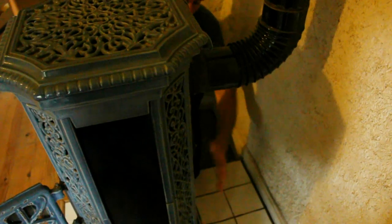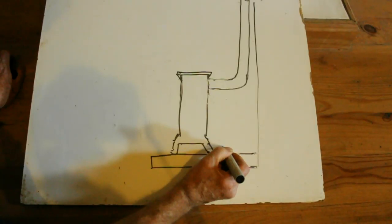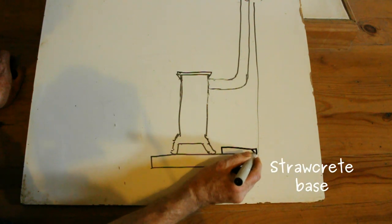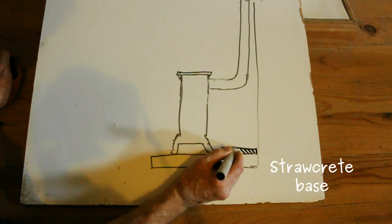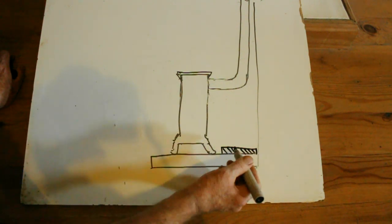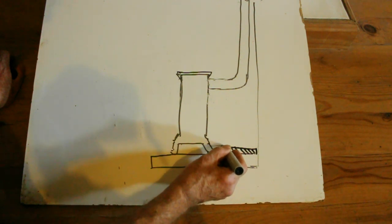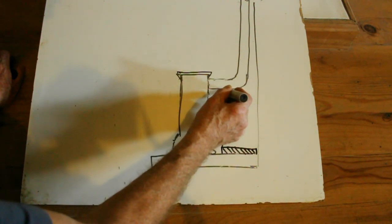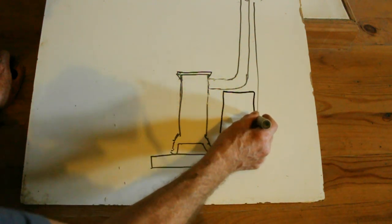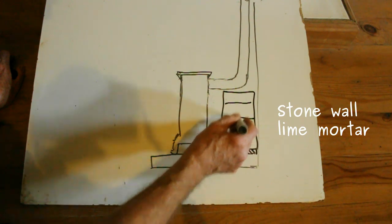So this is the rear of the stove. The rear wall here of the lounge — all this wall is insulated and I've got this space here. So what I propose to do is put down the strawcrete base here. That will insulate the wall from the slab here and then it will also prevent the tiles from getting scratched. And then I propose building this wall up like that and that will be stone bonded together with a lime mortar.